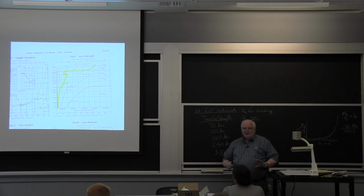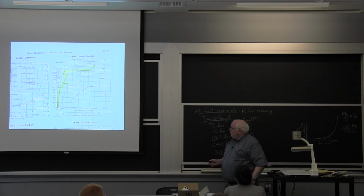Okay, well they use that unit because you basically take a sample of iron that's got hydrogen in it just after you weld, and you weigh it, you put it in a machine that's going to drive off that hydrogen by heating it up, and you measure the hydrogen, and that's how they measure it per 100 grams, and they normalize it to 100 grams of metal that you put in there. You saw how fast that stuff comes off.